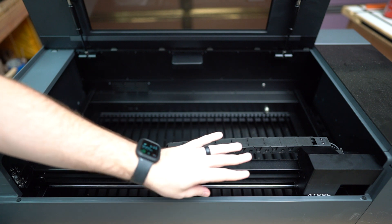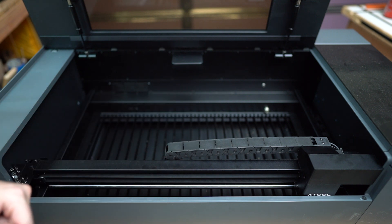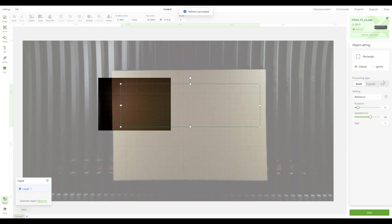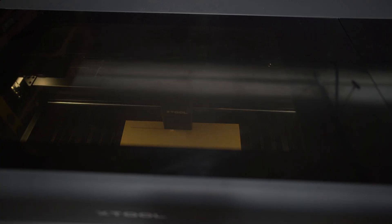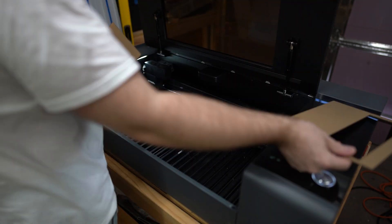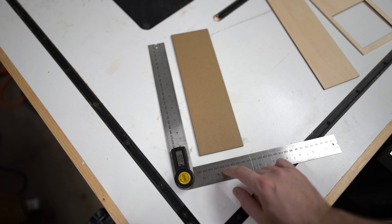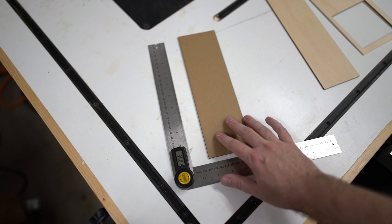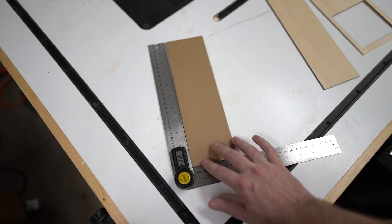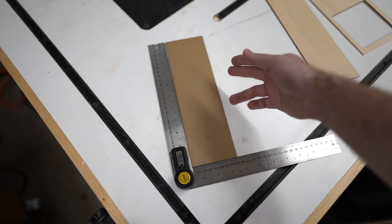This is a visual component — it's not the most scientific way to tell. The best way is to set up a test file. So I have my angle finder here set at 90 degrees. If you don't have one, I'll link it in the description. And here's my extended cutout from this cardboard. If I slide this over here, you'll notice we've got about an eighth inch gap on a 10 and a half inch piece of cardboard.